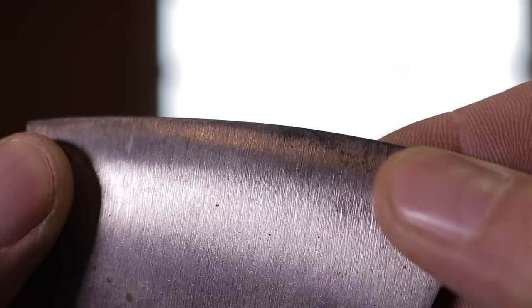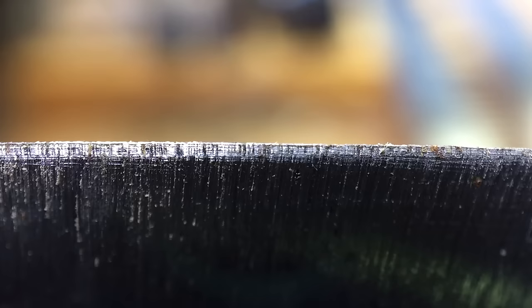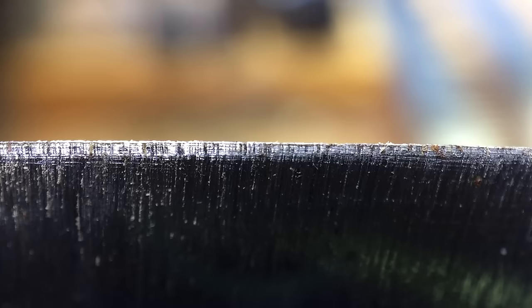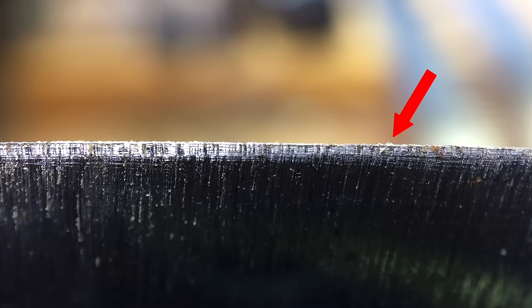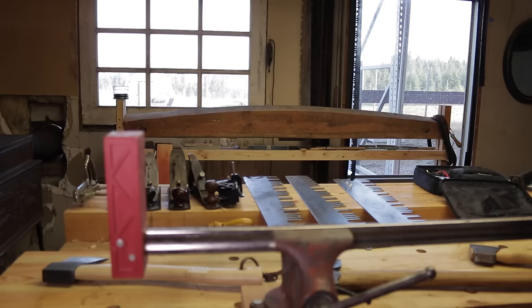Let's bring on the official Wrangler Star electron microscope and take a really close look to see what we're dealing with. This particular hatchet is a Prandi — an Italian-made hatchet, not currently available in the States, though that may be changing soon. What you see here is a really good factory edge. Look how consistent it is. You can see some small bits of rusting, and you can really see the striations of the steel, but overall really good. To the right you can see a little bit of burr sticking up, but for a factory edge this is actually really, really good.